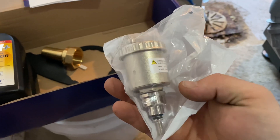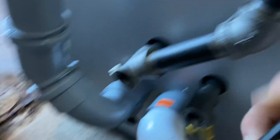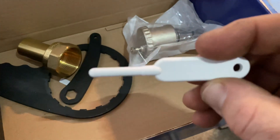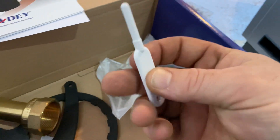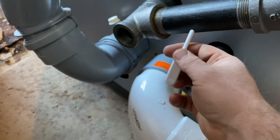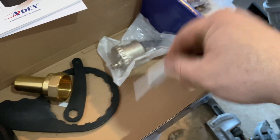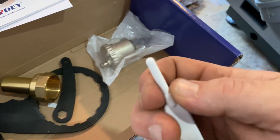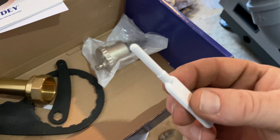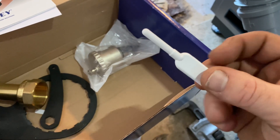The chemical pack is brand new to me today. You get wrenches for the filter housing drain on the bottom, and here's the rapid test strip — a really cool little device you can put on your keychain. It's a magnet. On a retrofit application, drain some water out of the system and swish this magnet strip in the boiler water. Any magnetite or dissolved iron is going to be attracted to it — living proof to quickly show your clients that there's a problem and you need to treat it with the chemical and filter.